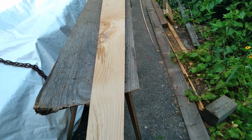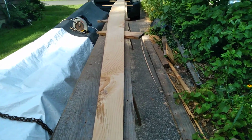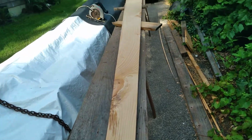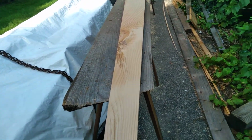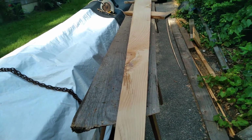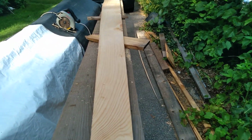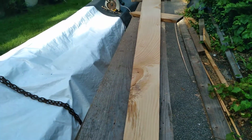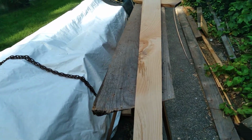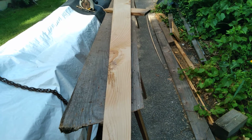If actual boards were coming from the mill with straight edges, the board is thicknessed and the edges removed, so they're not getting flitches from the mill. If they were getting boards, then there'd be a straight edge to start with to lay your pattern on for each plank. The other thing is if you are getting flitches from the mill with two rough edges, on either side of the log, then if you have a wide enough flitch and split that down the middle, and you split it with a straight line, then you can use that straight line on one edge of either plank that you cut out of that board. So it would seem to be one of the most efficient uses of wood.